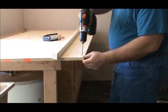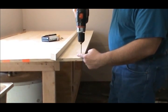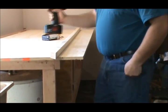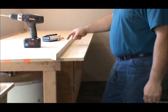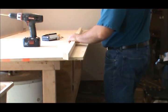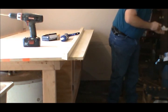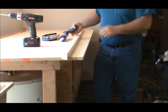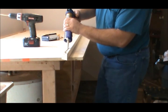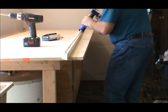I beveled this one at 45 degrees right here, so I'm going to drop back on the edge a good bit. What you could do is lay some glue down - I think I've got some glue. Basically what I've got here is some Liquid Nails heavy duty. I didn't really buy it for this, but it might be a good idea to go ahead and put some glue on here. It ain't got to be too thick - you just want to help bond it.